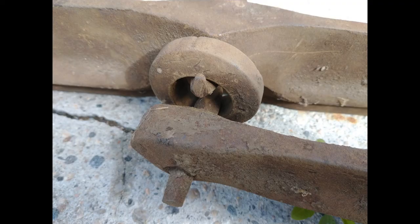This last shot is one of the two donuts that hold the two lever assemblies together. You can see they bent one of the little pivot bearings up a little bit to sort of retain the donut. I could not get this apart — I tried all different positioning and wiggling around, but I could never separate them. These pivot bearings, by the way, can be removed. I talked to a guy who worked at Fairbanks for about 40 years, and he told me these are a taper fit in the iron, which I did not know. He said if you need to change them you can knock them out and seat new ones into the tapered bore.